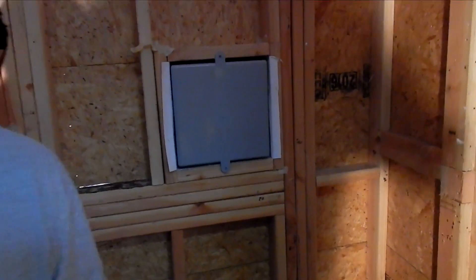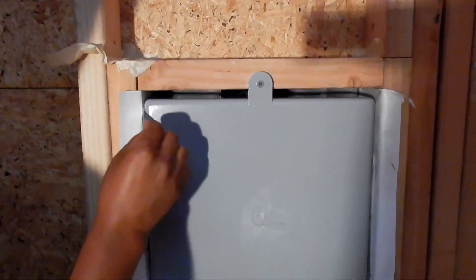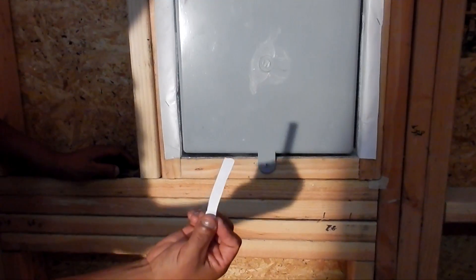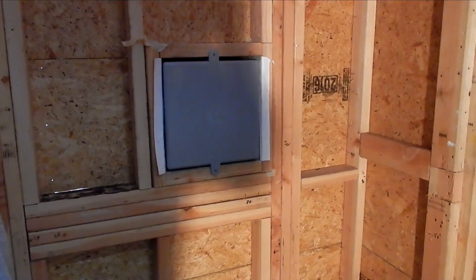We just finished our 15 minutes straight at 6.24 PSF. Checking the bottom — we are dry. This system worked: 15 minutes at 6.24 PSF using the Lightning Flash corners and the DuPont flashing tape, with a little bit of sealant at the seams.